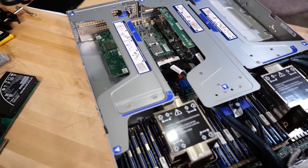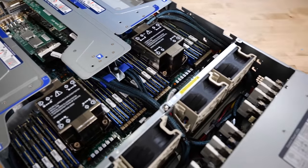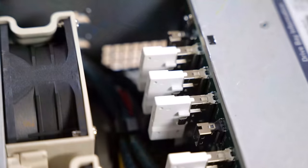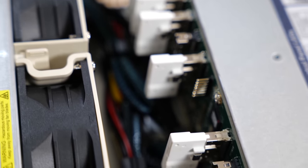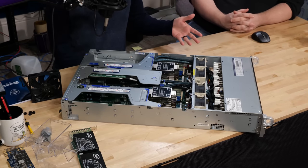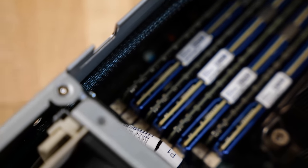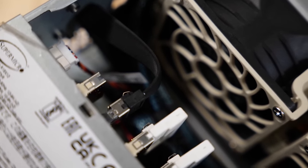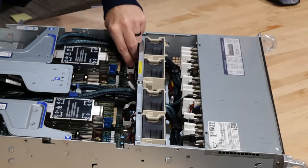This was literally going to be one of those show floor demos with four terabytes of persistent memory — and that's not even the crazy part. There are 88 PCIe lanes to the front, and there's no switch. They're all wired — all HBAs that are one-to-one, just retimer chips. It's literally bonkers. Almost every possible PCIe lane from every possible connection point on this board.